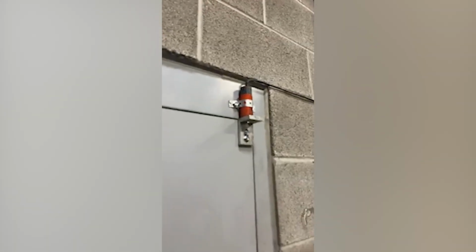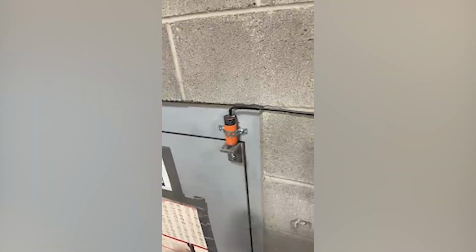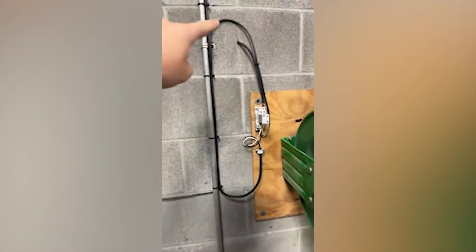I'm sure you guys have seen Home Alone and thought, how cool would it be to live in a house full of booby traps like that? Well, I'm grown up now and I'm an engineer. Let's kick that up a notch. This is called a proxy switch or a proximity sensor. What it does is send a signal whenever something is in the presence or not in the presence of its sensing field. So what we have here is a normally closed proximity sensor. It is off when the door is closed and it's on when the door is open. I have that wired up to a relay that comes from a 110 source down there that feeds the booby trap on the other side of the wall. So anytime that door is open, I know from anywhere in the plant whenever somebody opens that door. Come on, you can't make me an engineer and not expect me to build dumb stuff like that.